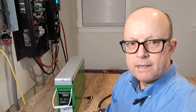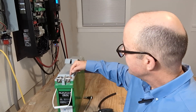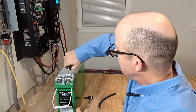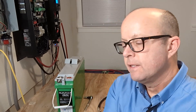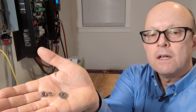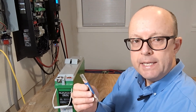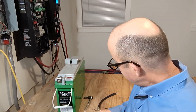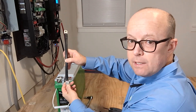Now that we have the battery out of the box, a couple of notes about mechanicals. First, the protective cover comes off easily enough. Next, positive terminal and negative terminal. We've got 5mm hex nuts that connect the brackets to the terminals. Each bracket has a 10mm nut which can attach a battery cable to the batteries. You can see a standard washer, a lock washer, and the nut. You don't have to use the brackets — if you're just connecting the plates to put the batteries in series, you can connect the plates directly to the terminals. But if you want to connect the battery cables vertically, you can connect the bracket and attach a battery cable to it, which I'll demonstrate next.